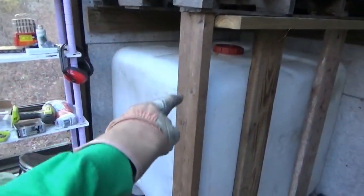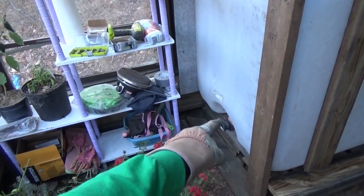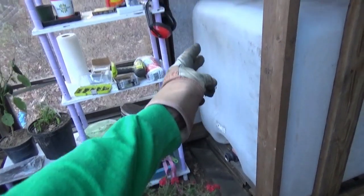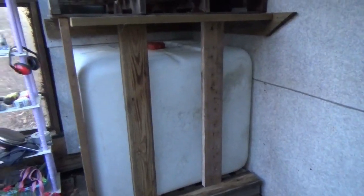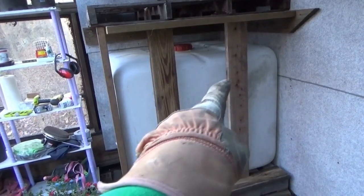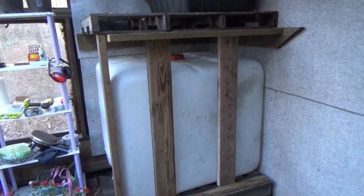I'm going to build a frame — this is one piece just sitting here on two blocks to give me the size and dimensions. I'm going to frame this in the exact same way, with basically four 2x6's leaving space for the faucet in between. I might even toe-nail in a couple of pieces to give me extra strength to keep that from bowing out. Here we have a good start of a frame. I might toe-nail in right here, once across and once down, just to give that some strength. Once I get the two pieces in, that tank is going to be trapped and caged like a wild animal — it's not going anywhere.